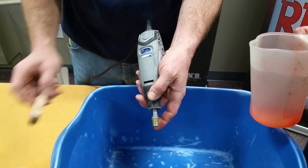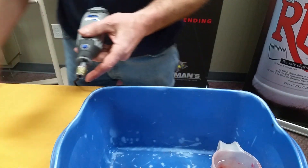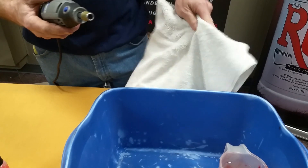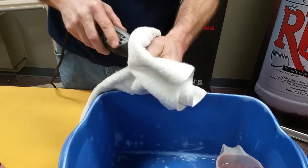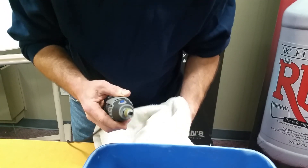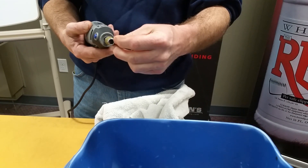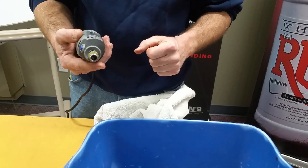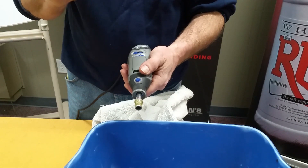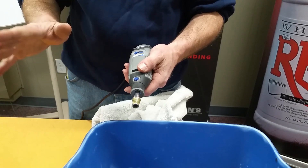Now that's all done. The brush goes away, and we're going to toss everything back into the imaginary sink. Now what we're going to do is take our terry towel, which is a standard bath towel. We are going to daub it off, press against the tool, and then blow through the holes and dry the tool. Why do we blow through the holes? It gets the water out of the inside of the tool, inside of the holes, and the air holes in the back. If you leave water inside, this diamond groove will rust — you do not want it to rust.